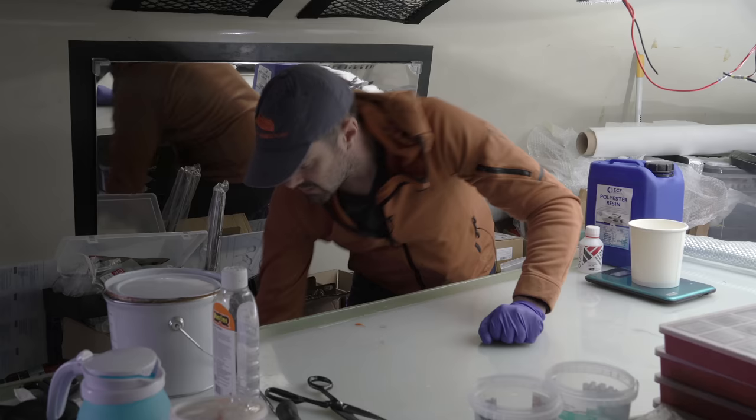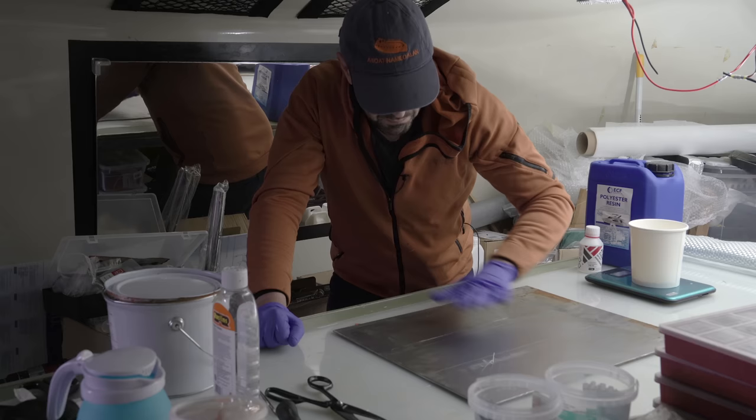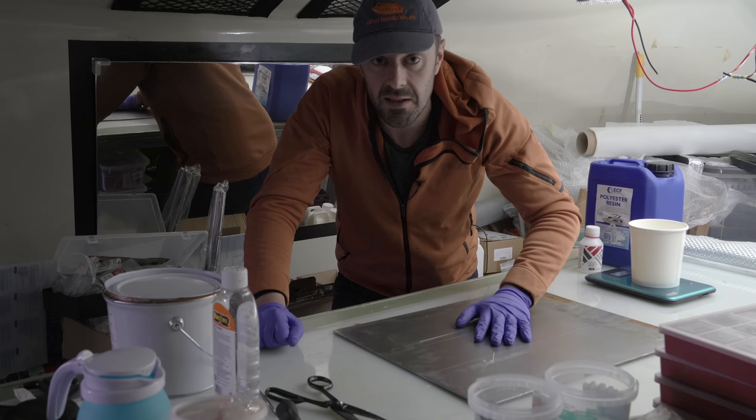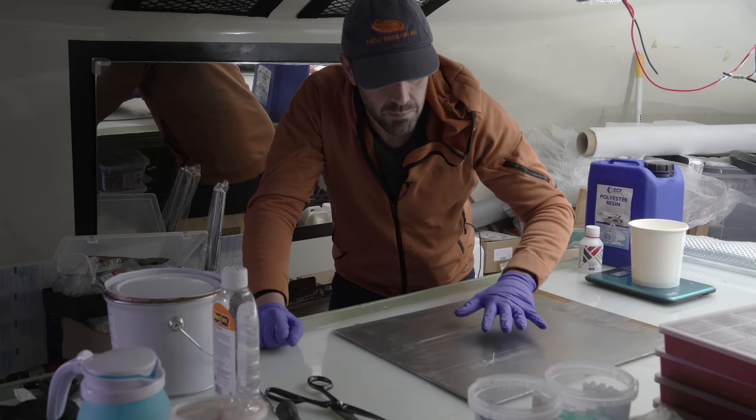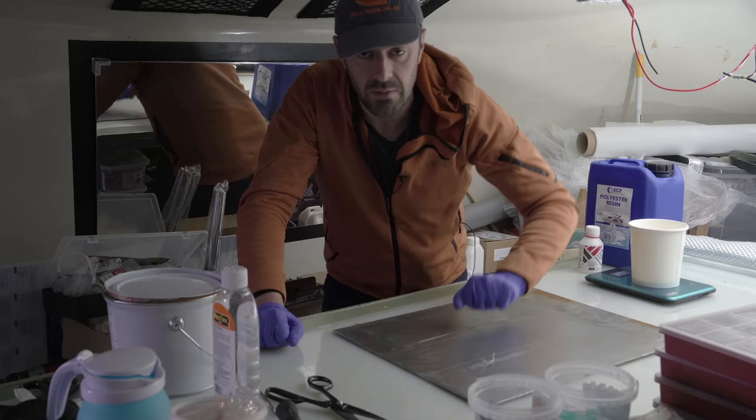Here is a plate of mild steel, and this will need to be glassed on both sides and sealed in. This is going to become the new rudder, because the rudder I was using before I just kind of whacked it on hoping for the best three years ago to try and improve manoeuvrability — and it had a really good effect — but I think we can do better. I've now done some more calculations, looked at ratios and so on, and I think a slight enlargement, not vertically but horizontally, is going to be a good idea.